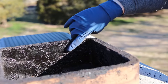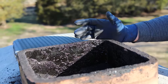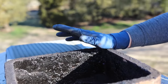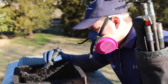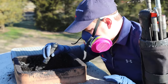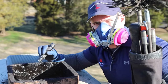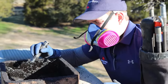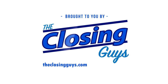The shiny stuff we have here is what we call third-degree glazed creosote. It's from the moisture inside the wood — it gets gunked up, covers the side walls of the flue, hardens, and glazes over. Now I'm just checking it to see how much stuff came off. Unfortunately, there's a lot of third-degree glazed creosote on here. The only way you can really get that off is either with a chain whip — which I don't like using because it could cause damage to the flue liner — or there are chemicals that you can use. I'm going to run that by the customer to see if that's an option they want to pursue.